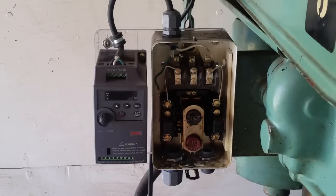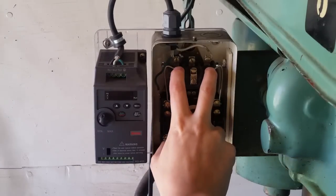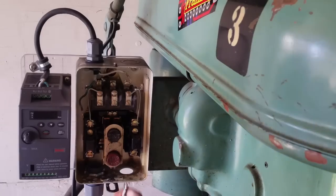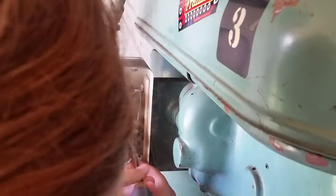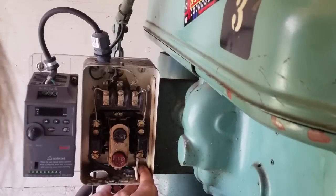What I'm going to do is bring power in from the wall and connect it to these terminals right here — actually I can connect them right here because this is all connected as a block. I'll have hot and neutral come in here, go up through to here, and then when I press Start it'll connect power and travel through this wire and turn the VFD on. Right now I just want to see if the VFD gets power when I flip the start switch on.